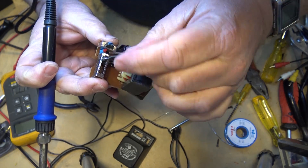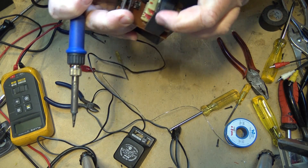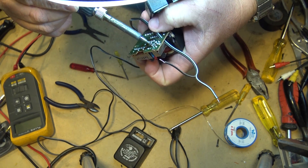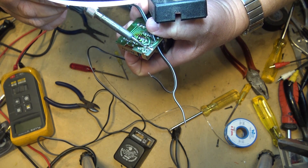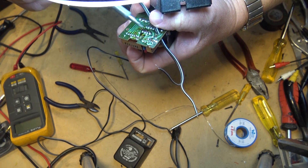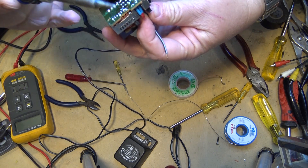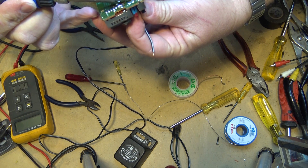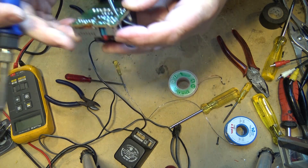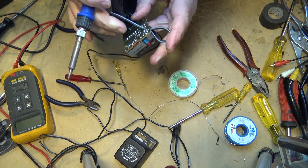We'll just poke the wire down on either side of the switch here. I'll try not to burn up my HDMI cable to my monitor with my iron. What kind of solder is this? This isn't lead free, that's for sure, but it's really not very good — it's dull, flaky, just garbage. Okay, I got the wire through the board here. I'll go back in, just tack this down for now so I can get it in place, and then I'll go back and put some more solder on it. That'll hold it. Now I want to re-solder it properly.